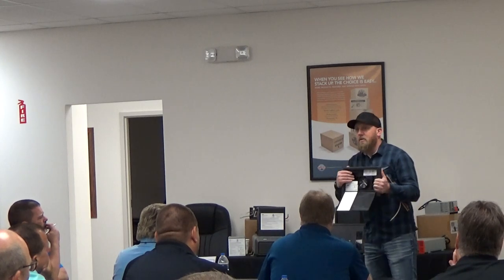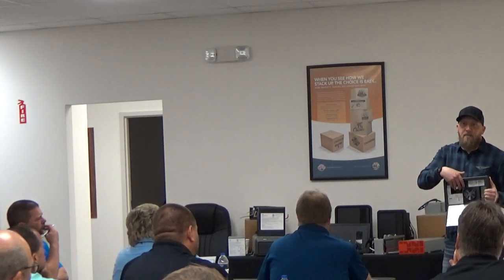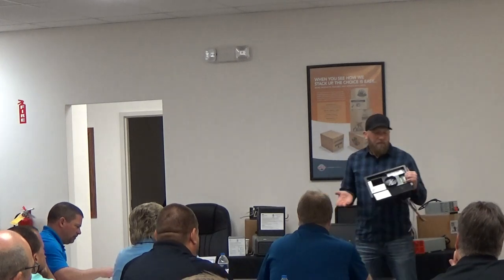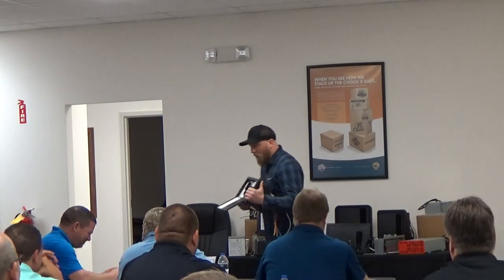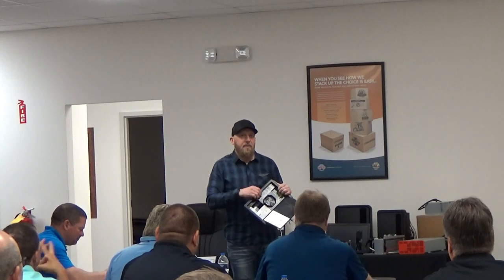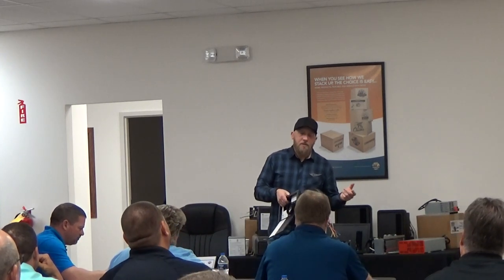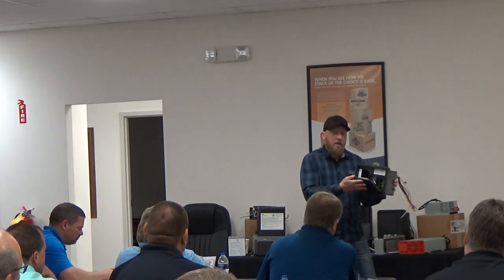Another thing I should tell you guys, converters do not come with breakers or fuses. So I get calls sometimes because if they look at some of our aftermarket boxing, it has breakers and fuses in the picture, but they're not provided with breakers or fuses. And like I tell people on the phone, also in that picture there's an RV and there's this girl in a convertible and those don't come with it either. We can't provide breakers and fuses because we don't know what their loads are gonna be, so you can't provide across the board breakers and fuses because everything's gonna be wired differently, so you break and fuse according to what the load is gonna be. But what we do provide is a reverse polarity fuse in all of our products to protect it in the event of hooking up your battery backwards.